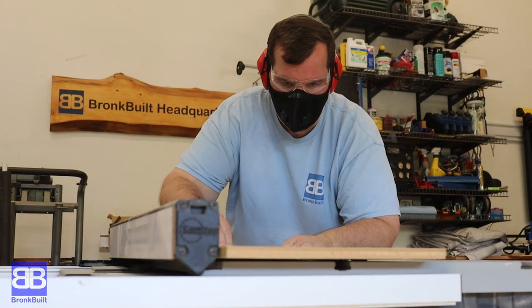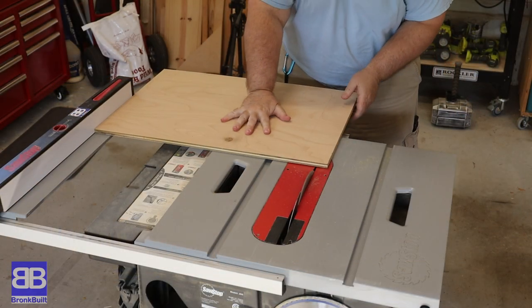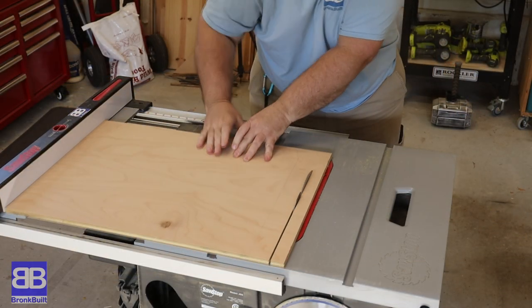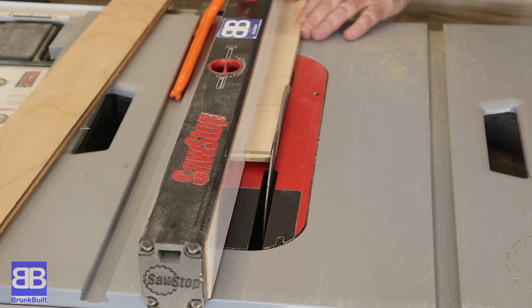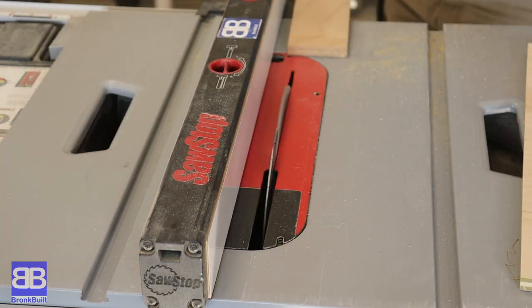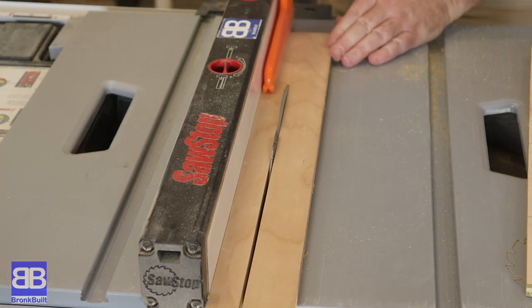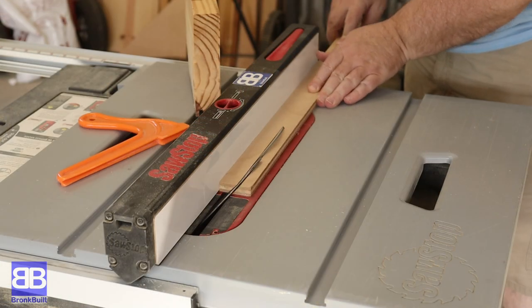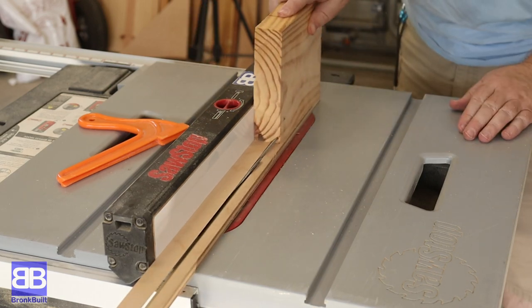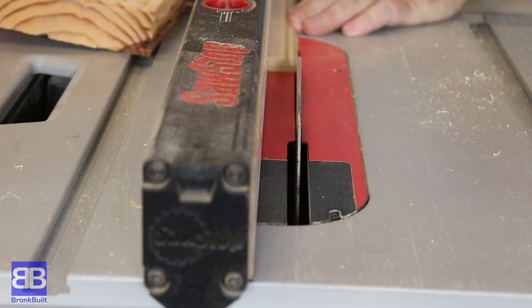The first thing I need to do is cut a scrap piece of half-inch plywood down to size — about 24 inches by 18 inches. Next, I rip down a couple pieces to about one inch wide for support. Then I take a two-inch wide scrap and rip it down the middle at a 45 to form my French cleat. Those 45 cuts leave a very sharp edge, so I trim off about a sixteenth to an eighth of an inch to remove the sharpness.